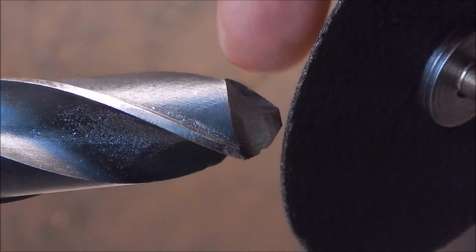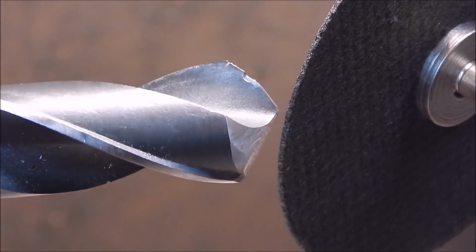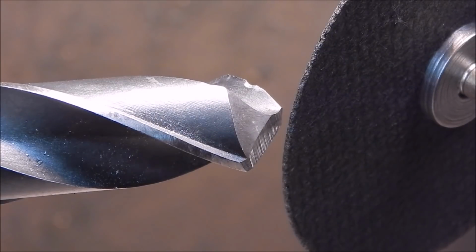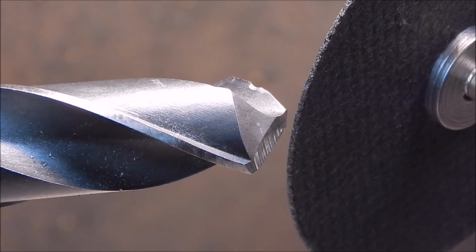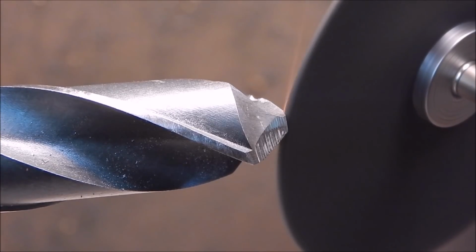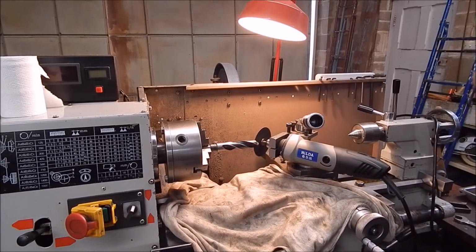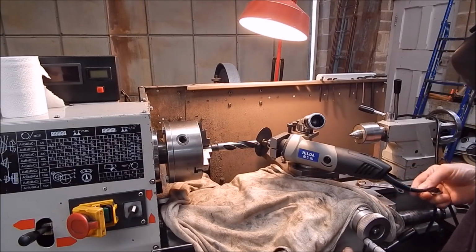You can see now that this cutting edge is straight, and the one to be done is still curved. So now we basically line this up at 90 degrees and we grind that one. We haven't moved the carriage, we'll just come straight through and clean it up. Okay, I've just done that on one pass and see what sort of result we've got.